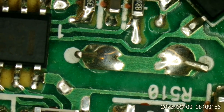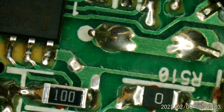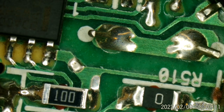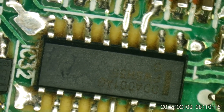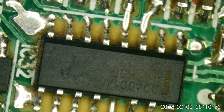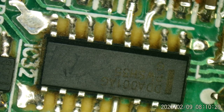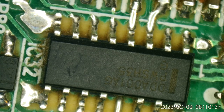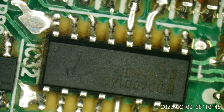But this gets into why is it shutting down. I need to see — is the 12 volts trying to come up, do we get a little bump of it and it shuts down, or do we never get any of it? Because the 12 volt IC could make it shut down, and the power factor corrector IC could be shutting down — we don't know which one it is. Let's flip it back over, plug it in, and see how high the voltage is getting across those large filter capacitors. Is it making it to around 400 volts or is it falling short? Are we getting any 12 volts? Sounds like a good place to start.